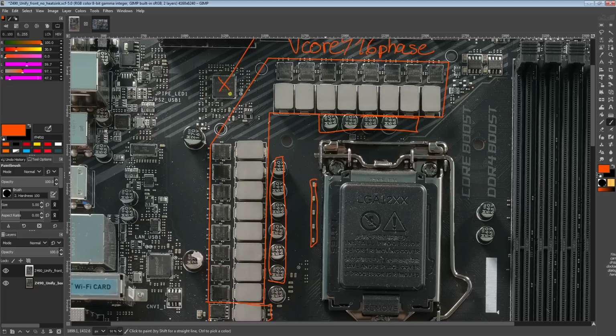Ultimately, we need to ask the oscilloscope about that, because I can't eyeball this. There are too many variables. How's the power plane designed? What capacitors are in use? Where are the capacitors? How are the capacitors connected to the power planes? How is the voltage controller firmware configured? Too many variables. But at the same time, this is not confidence inspiring.